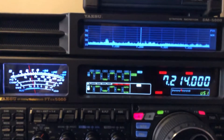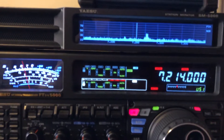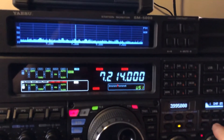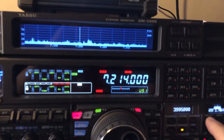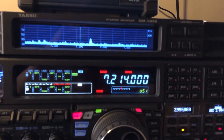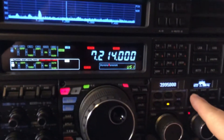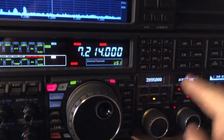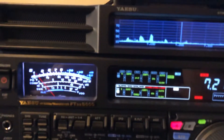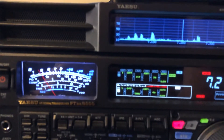Of course, the idea is to improve the signal-to-noise ratio. And let me leave on a positive note here. Digital noise reduction. Filter width — I can widen that if I want to, or narrow. This sounds pretty good at 2.5. And microtuner. Yeah, there's some insertion loss with the microtuner, but it's all about signal-to-noise ratio. Really, it's all about intelligibility.